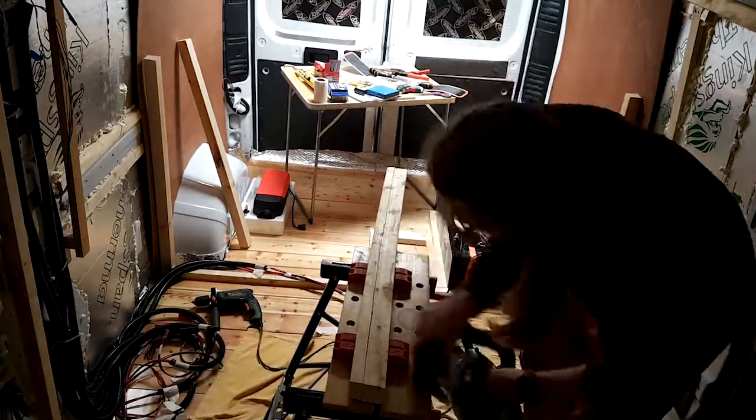In the initial stages, I think it would have been these two lights here above the desk. I discovered something rather awkward — the lights that were supposed to fit inside 32 millimetre holes, like push-fit into these holes, didn't actually fit into 32 millimetre holes. I did suspect maybe the hole saw was a problem, but when I measured the two, it was pretty clear the hole saw was accurate. In fact, the lights were just wrong about what size hole they needed. It definitely was bigger than 32 millimetres, because there was no way they were getting in these holes.